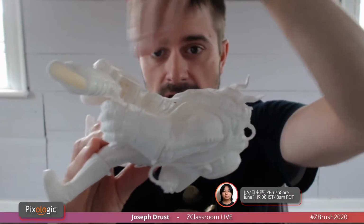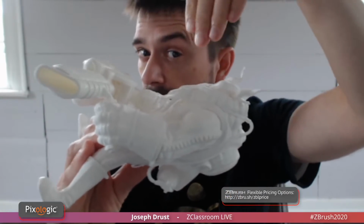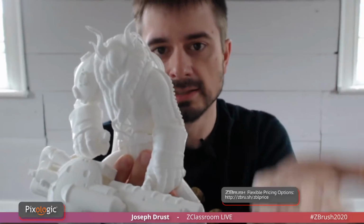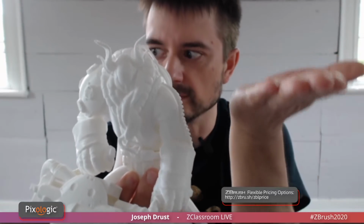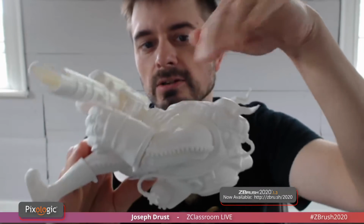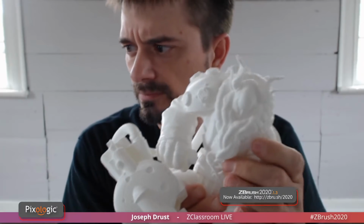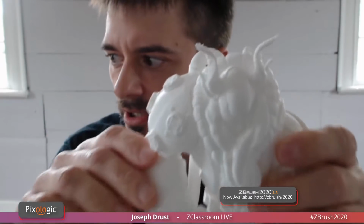And this is just because your X and Y axis on a 3D printer are going to be your lowest resolution compared to the height. So this can be controlled a lot easier and give you different height variations for your Z depth, but then your X and Y is going to be lower. So that's the main thing with any FDM prints to get the resolution on it. But he himself is actually at an 8-inch size for this model.